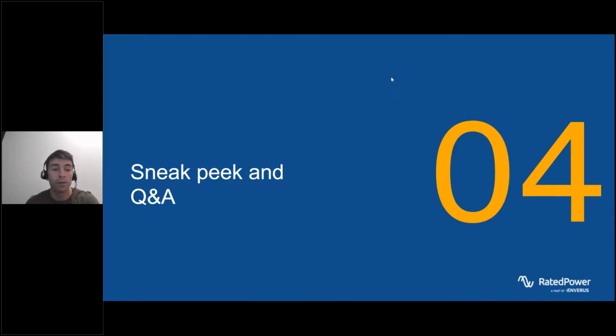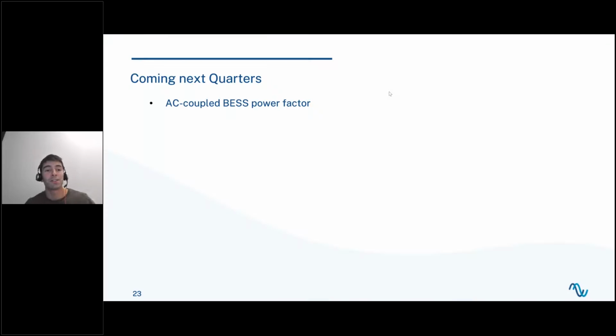And with this, we arrive at the final part of the presentation, the sneak peek and Q&A. First, I want to share with you what's coming in the next quarters, and you may be laughing now because there's only one thing there, which is the power factor for AC coupled BESS. But this is something big, something that people have been asking for. For those of you who don't know what it is, it's basically taking the AC coupled BESS system into account for the power factor requirements. The PV plant right now has a global requirement for the power factor, but the BESS is not taken into account, and it should be, in order to comply with this power factor for the PV plant.